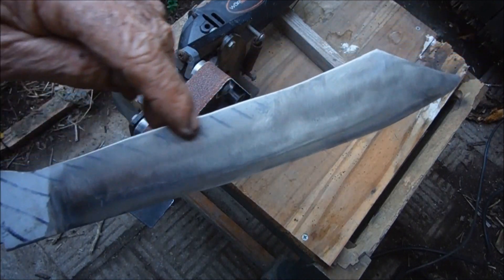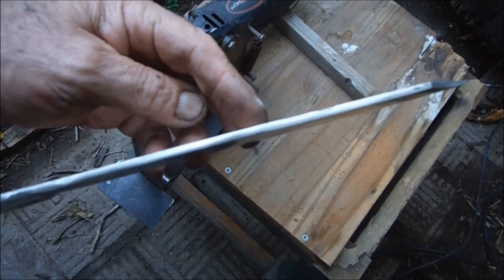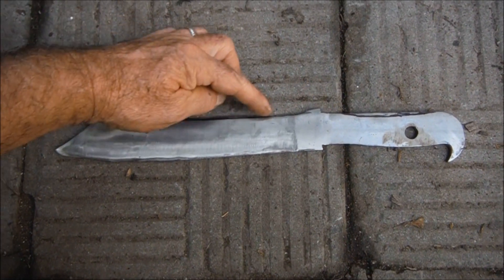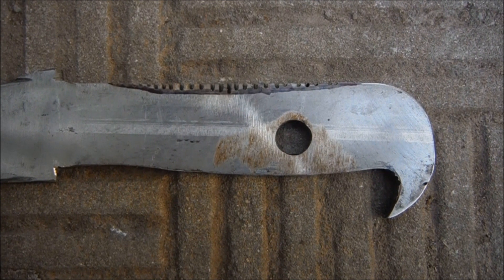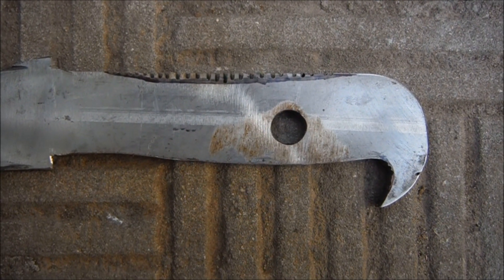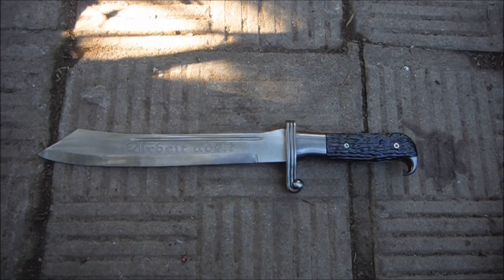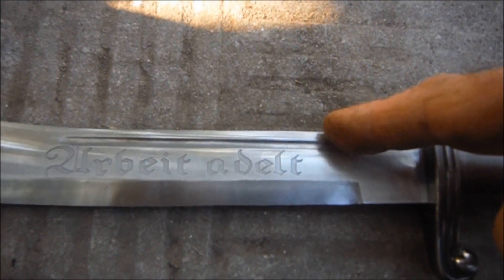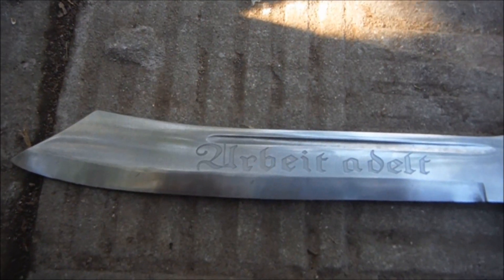As you can see I've polished away most of these lines. I've actually been trying to thin it from here onwards so that it has some distal taper. I've got a couple of refinements to make to the shape — I haven't got this quite right and I also need to add this curve. There's also a little bit in the hook of the eagle's beak which I need to tidy up. This modern replica of the original German knife has a very short bevel to allow space to write a slogan. I think the original knife was actually beveled continuously from the spine to the cutting edge, and that is what I've been hoping to achieve.